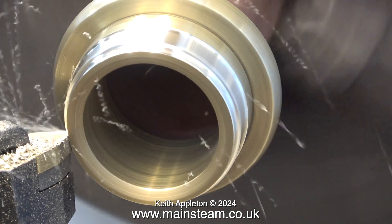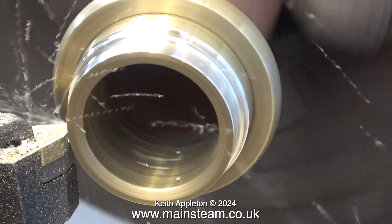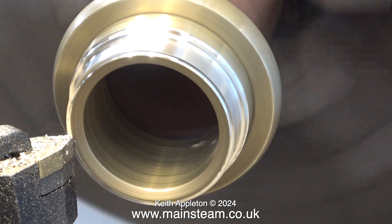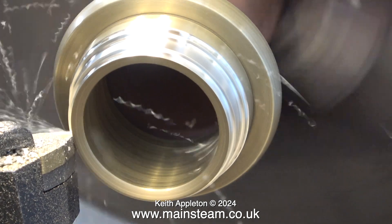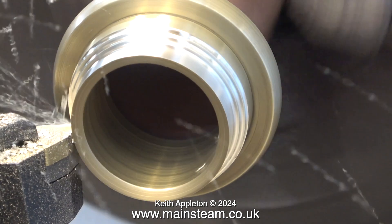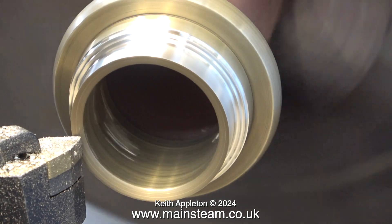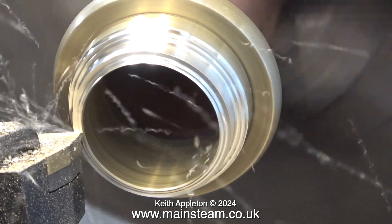What I'm doing at the moment is reducing the diameter of the chimney top cap because originally it was far too thick and looked ridiculous. I'm using my Smart and Brown lathe for this job because it has a four-jaw self-centering chuck which is large and accepts most of the chimney tube, so there isn't too much sticking out. My recommendation is to take it easy when doing jobs like this, because if you make a mess of it and the lathe tool grabs the work, the power of the lathe and the large chuck will chew up the chimney tube very easily.